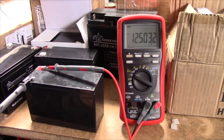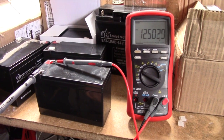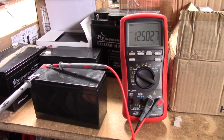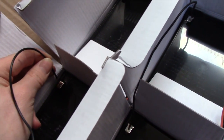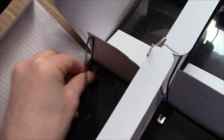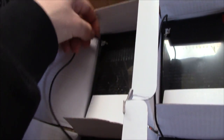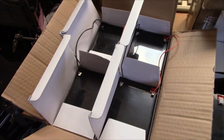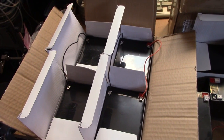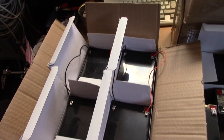It would be nice to be able to just use these things right out of the box, because returns to the store they came from are probably not a lot of fun. Once you've checked your batteries, the second thing you want to do is charge them. Even if they read kind of full on the OCV, you always want to charge your lead-acid batteries the moment you get them. And if you're lazy like me, you'll just hook up a heap of them in parallel and charge them like that — it's generally not a problem, and you get a bonus balancing operation at the same time.